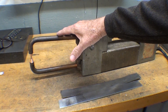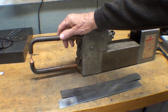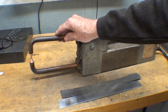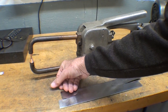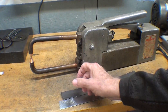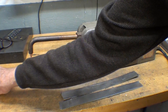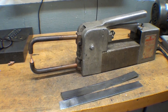We can produce thousands of welds — usually produced by a robot in an automobile body shop — so it can be highly automated. On those big machines the tips are water-cooled, as these get very hot. In high school I can't tell you how many times kids were burned on these tongs. The tongs are available in many different lengths and shapes, and I think when you buy this machine it comes without any tongs — those are about $100 each — and then of course you can buy extra tips, which are the consumables.